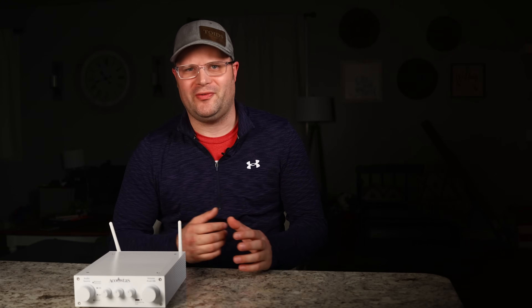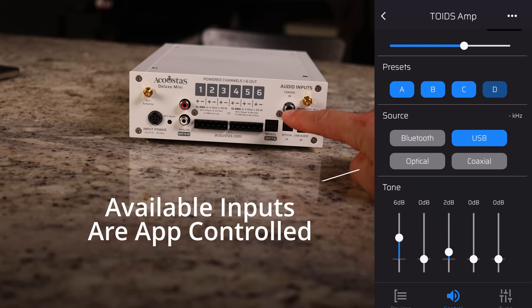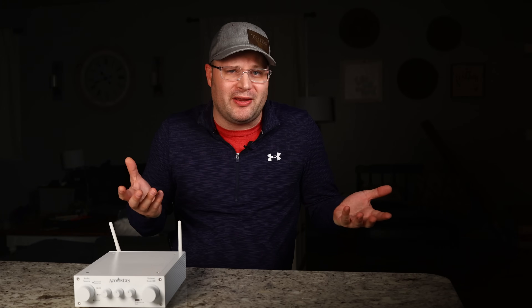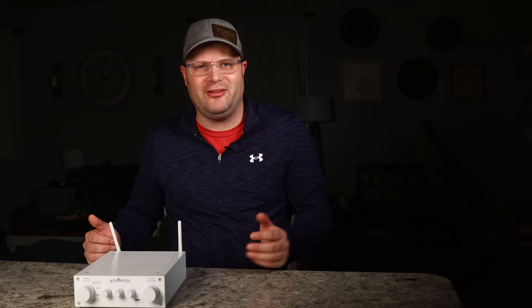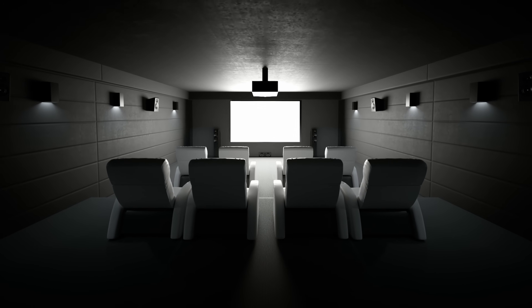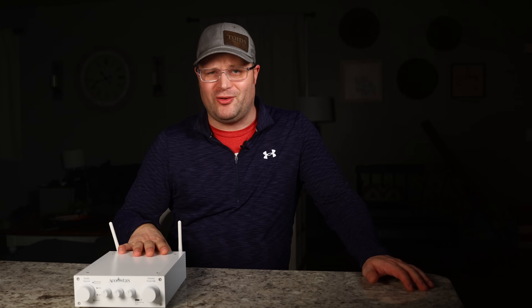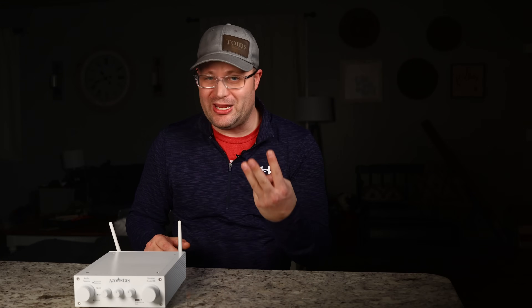In theory, that would make this process very straightforward and simplistic, but since I can't test that, it will remain a theory. For all the good of this amplifier, there are a few head-scratchers — like there's no analog RCA input, which I would assume would be on a stereo DSP amplifier. Instead they put a fiber optic, which means you could buy a converter to convert analog to digital, but that adds to the cost and complexity of what should be a very easy-to-use system. On top of that, while there are 10 DSP outputs, you can't use them for multi-channel surround sound — the input side is still stereo with only one right and one left input. If you wanted to use this for even a 5.1 system, you would need three of these amplifiers. So for now, this is really for stereo enthusiasts.